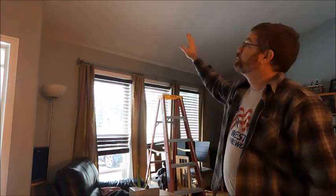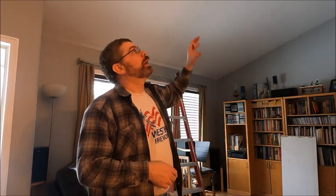What we've done is used some very long wood nails to drive up through the drywall, so that when I get up into the attic I can actually find those locations and see how they correspond to the rafters. We're going to have to probably adjust for the rafter spacing to have enough room to put the hole in for the can lights. This should allow me to easily find these locations, clear away the insulation, and make the final adjustments for those holes.